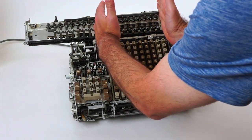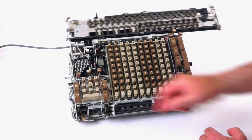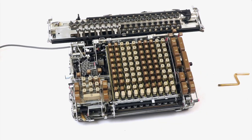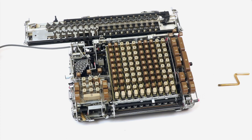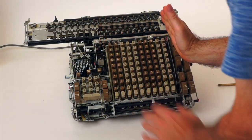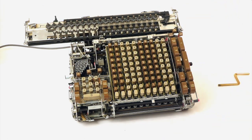The calculating portion is only 10 digits wide, and it just steps through the accumulator. Something I had not recognized is that since the calculation section is only that wide, how does it do the carry through the whole thing? How does it reach the end? And the answer is that in some situations, it does not.